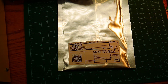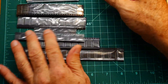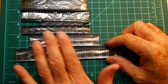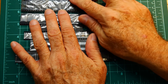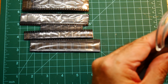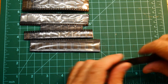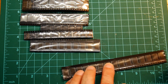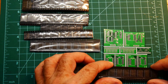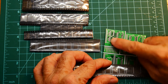Let me open these up and take a look to see if they're the right package sizes. Here are all our parts, and we have some wide and some narrow parts, so I just need to make sure the boards are laid out correctly. This is a 541, and that's a buffer — the right size. These are 0.6 inches and the little ones are 0.3 inches.